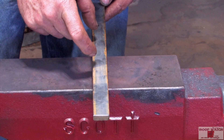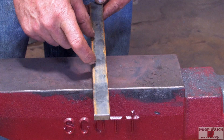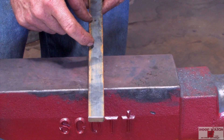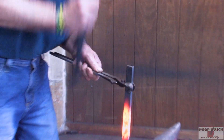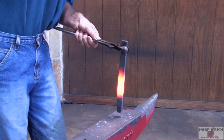If you bump the toe, you're just trying to get rid of the material you bumped in the toe. I'm going to take two heats anyway — I'll focus one of the heats here and one of the heats here, and I'll have the material where I want it instead of having to squish it out. As you can see, I got the one side bumped more to one side than the other.